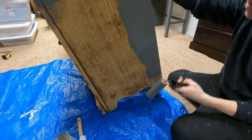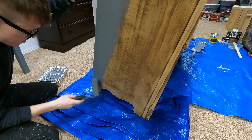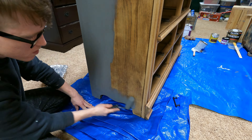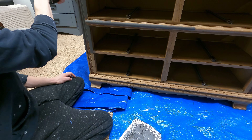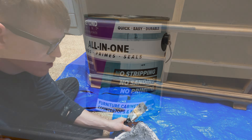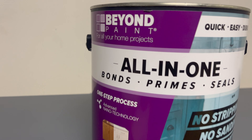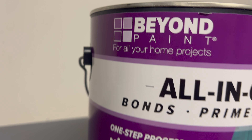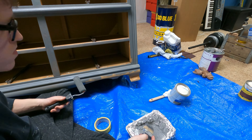After I marked the new holes on those dresser drawers, I went back over to the dresser and threw on one coat of Beyond paint onto the dresser, so the paint will dry and cure and then I can get back to drilling those holes. The reason I use Beyond paint for this project is that it is a primer, paint, and sealer all mixed into one, so you don't have to prime or seal separately, which is very nice.